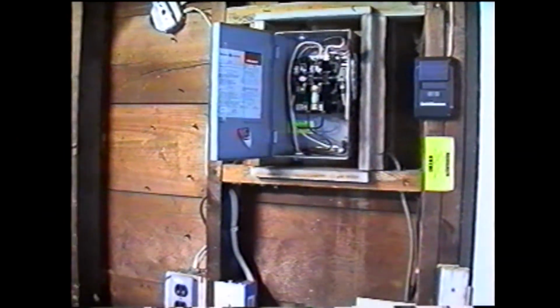And pull the fuse. That's the fuse right there. I'm going to go back and turn the circuit on and then see which outlets and lights are connected to it. So I did turn the circuit back on, and there's a couple of light switches. This one here is a light switch right there. There's another light switch for the exterior, but I don't think that's going to be working. But you can see the lights up here are all working.